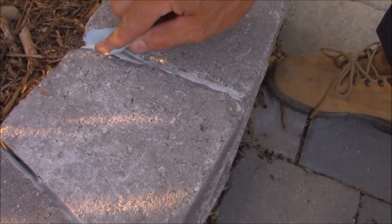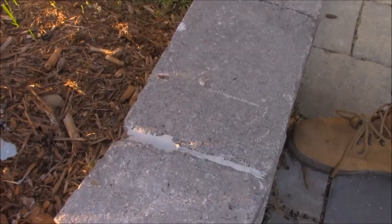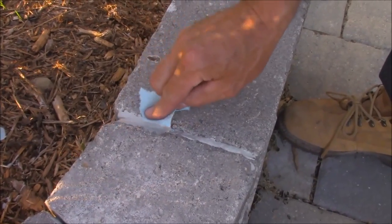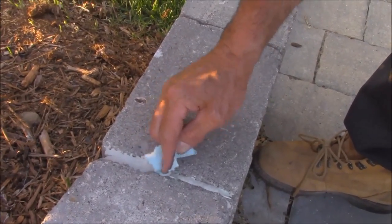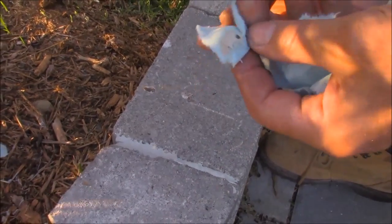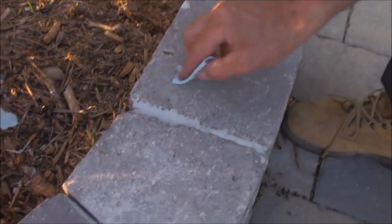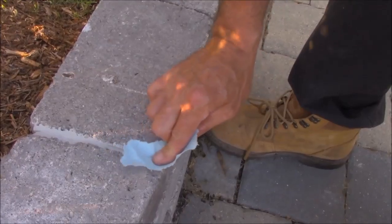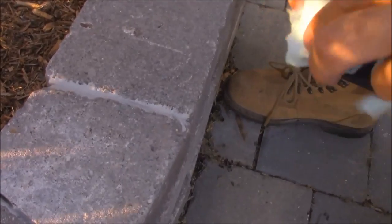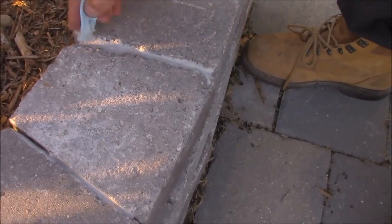So when you put it in and you want it to look good, you wipe it off. When you use a gun-grade caulk, it's thicker — it's not self-leveling, it's not liquid. When you put it in, it will hang and it's thicker, like window putty. By using these many little napkin wipes, I have not smeared any caulk — I've only removed it. So it makes the joint look a lot more professional.